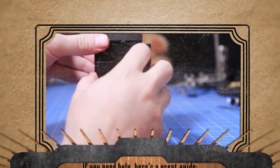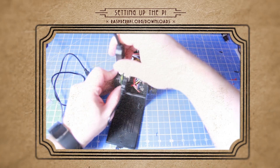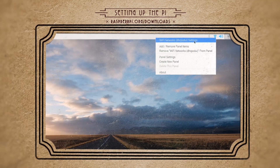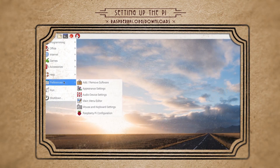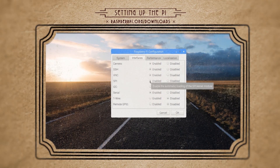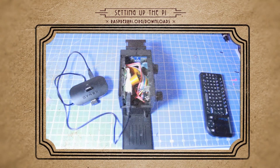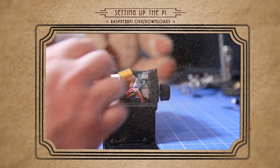With Dropbox done, let's finish up the camera. Assuming that you have the Raspbian OS installed on an SD card, an HDMI monitor, and a powered USB hub plugged in with Wi-Fi, mouse, and keyboard, let's power it on. Select the Wi-Fi settings and set a static IP for the Pi. Then in the Raspberry Pi configuration settings, make sure the camera is enabled, SSH is enabled for remotely connecting to the Pi, and SPI is enabled for the LCD screen. Reboot the Pi, unplug the HDMI cable and USB hub, but make sure the Wi-Fi card is the only thing in the USB port.